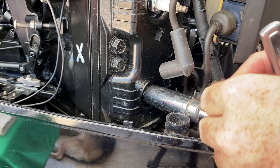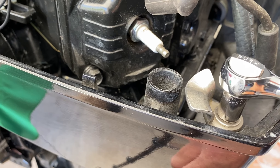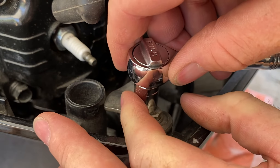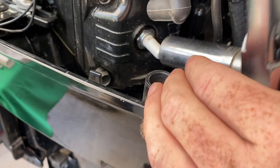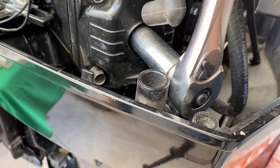You'll be using a 13/16 inch spark plug socket. At cylinder number six we had trouble getting the socket in because of the cowling latch, so we removed the cowling latch and set that aside. At that point we were able to get the socket to fit in place.